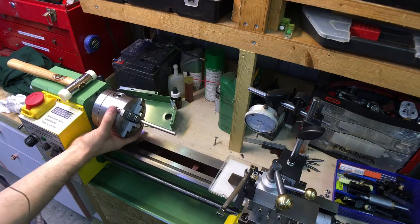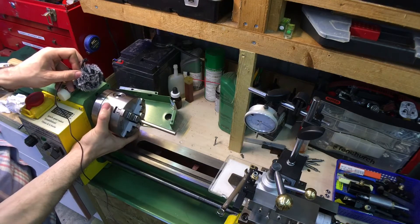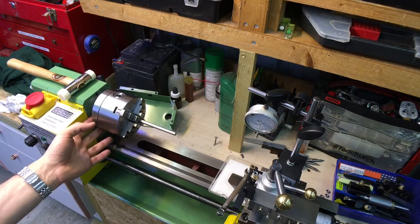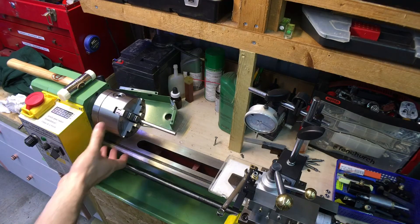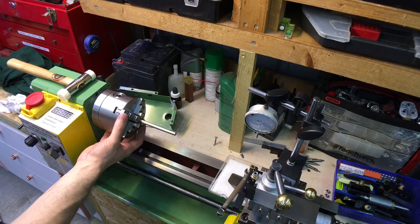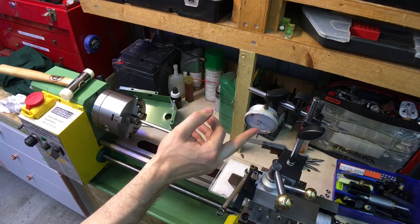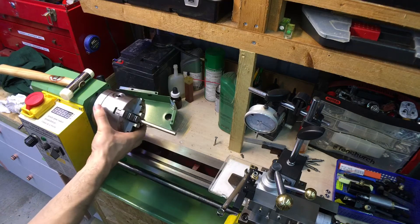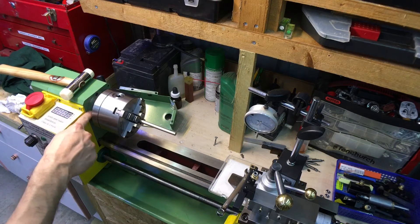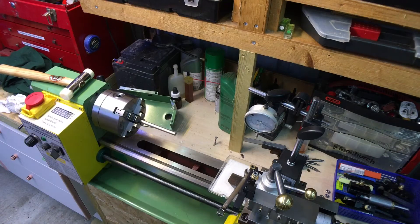The chuck is on and hanging by the nuts now. There is some play in the register, and that's actually supposed to be like that. Because I'm just a hobbyist, I don't know all the terminology — but the reason for that play is so we can snug the nuts up on the back, not too tight, then use a dial indicator and a mallet to find the high spots, turn it to the low spot, and tap it true. Once the chuck is completely true, we tighten the nuts fully so it's completely concentric.